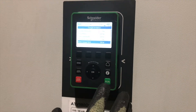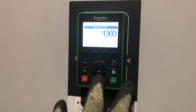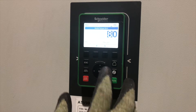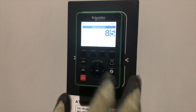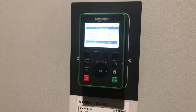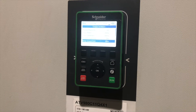We can see a torque limit of 100% which we've got here. We could change this depending on the application — in this case we're going to change it to 85%. Press OK, and we've now changed the drive parameters so that 85% is the maximum torque permissible for this drive.